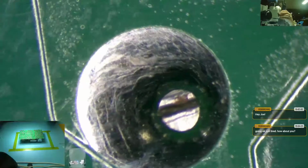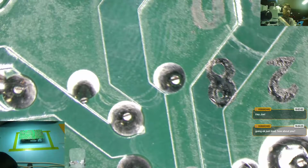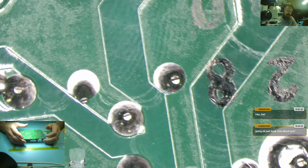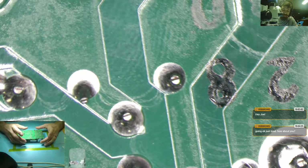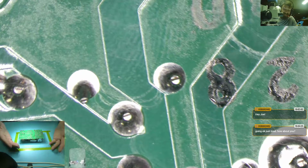But this particular system has an error 19 that it's throwing, which isn't really in the normal service manual, but in the special one it is, and that says that there's an overvoltage on the 5-volt line, which is really weird. That makes no sense, why there's an overvoltage alarm on that line. So, let's check the power supply that makes the 5 volts, right?